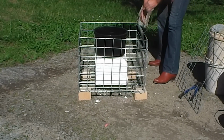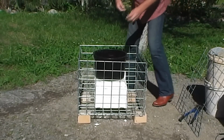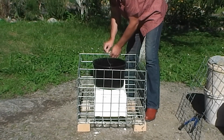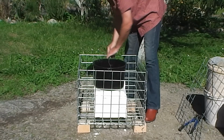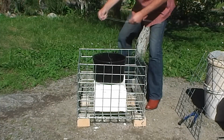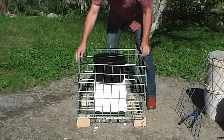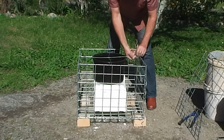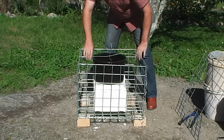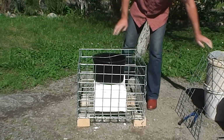The top tip with all Gabions is to put a temporary wire across the top, which will stop the cage blowing out. A little brace wire across the top keeps the whole thing true and straight, so when we go to put the lid on, it fits. So there we have it, ready to put our rocks in.